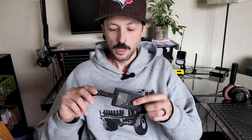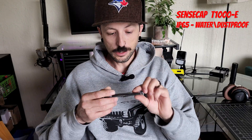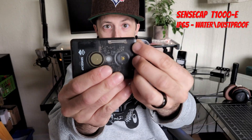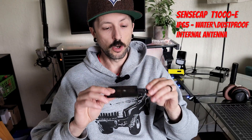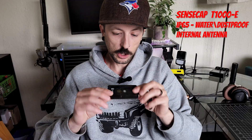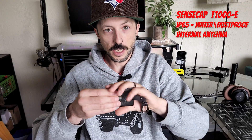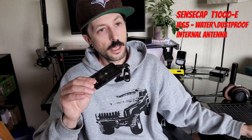Jumping over to the T1000E — this is a bit of a different device. It's an all-in-one and it is waterproof. It has an internal antenna right inside the unit that looks like a little comb. The antenna works fantastic on receive, though getting out is a little more challenging since the internal antenna is inside the device — inside your pocket, wherever you carry it. It is a little bit tougher than using an external antenna device, but the receive capability is fantastic.